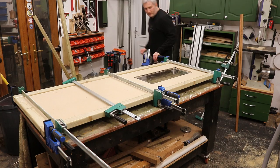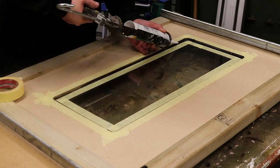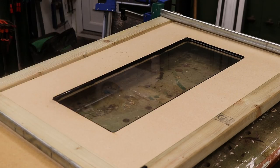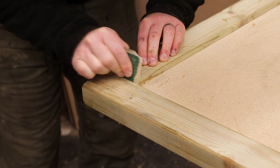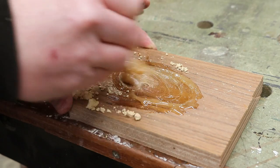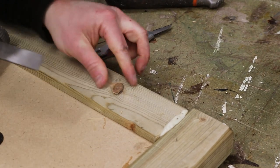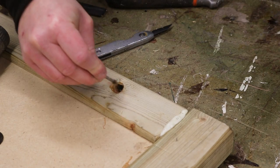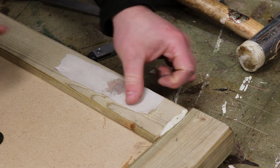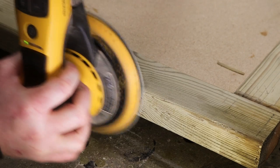If only the first glue-up was that easy. This seemed like a good time to seal up the other side of the window, and again I'm using masking tape just to keep clean lines. And I can remove the excess foam from the polyurethane glue. I mixed up some epoxy with a bit of sawdust and I can use this to fill any imperfections in the wood like these knots and cracks. Once this is dry I can sand off the excess and get it nice and smooth.